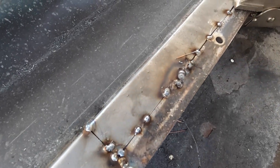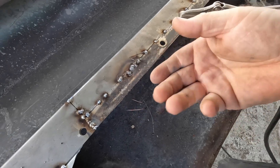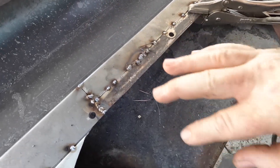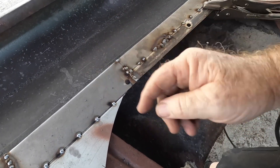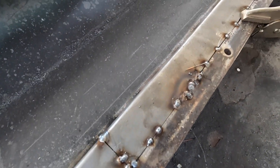This is where that hole was — I think we got it pretty good. I put a small piece of metal behind it and butt-welded it up against it so the wheel well mounts flush. It won't hurt anything to put a little metal behind there. Made it easy to fill that hole. Let's keep going.